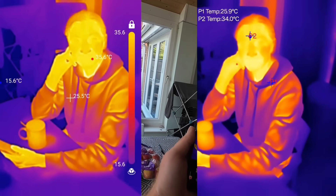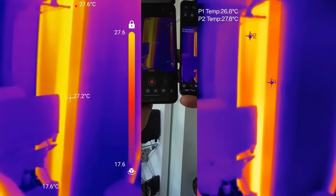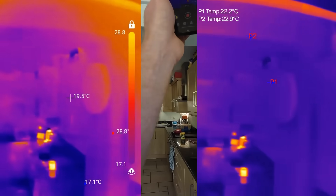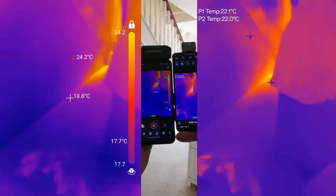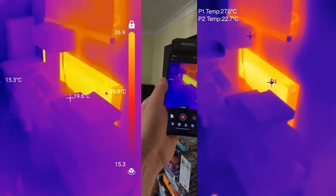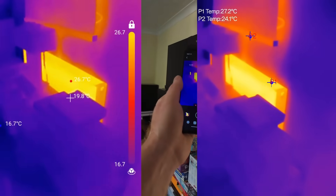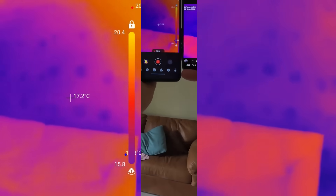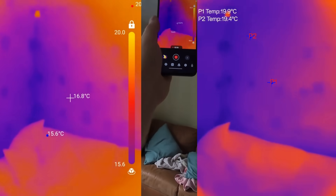My wife has just had a hot chocolate — specifically she's 35.6 degrees. You can see that it's heating season now; the radiator's on. You can see that someone hasn't finished their hot chocolate, and the kettle has been used. Let's go and look at some of the other stuff I've already looked at in previous videos. That radiator is only showing around 27-28 degrees, but it's shown up very clearly. The P2 I think is showing the temperature variations a little bit easier — if you look at the cold spots of the dot-and-dab, that's easier to determine.